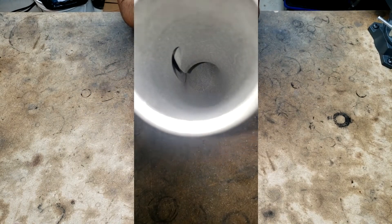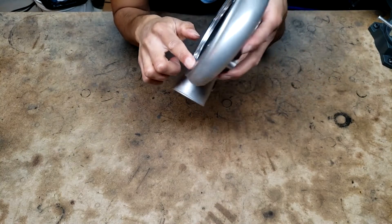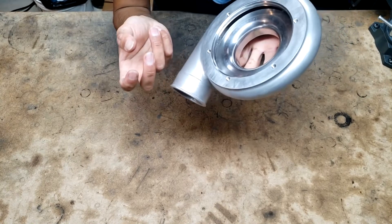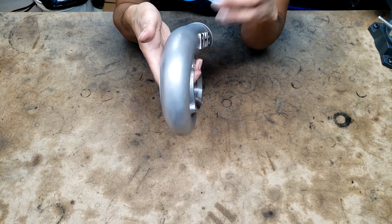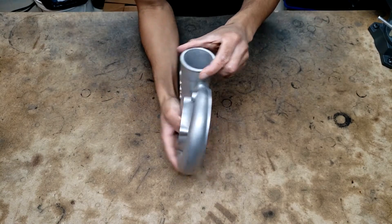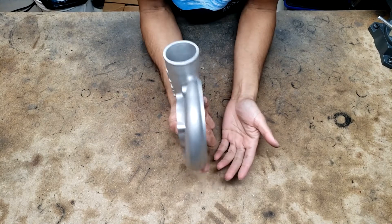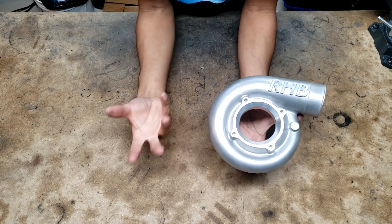This was polished a little bit just to remove the supports. Upon machining, my machinists noted that this material is a bit different from cast — you can tell the material itself was stronger just by the chips coming off it. Castings usually have small areas of porosity inside that you can't really get rid of. Since this is welded from the ground up from powdered aluminum, there's no porosity.